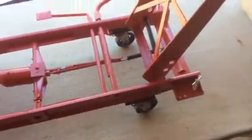I wanted to make it a little bit larger. This bed is 7 feet long and 27 inches wide. I wanted to make it a little bit bigger, so I took a piece of plywood, an 8-foot piece of plywood, and cut it down to 3 foot. Put these little cleats on it that'll rest against the edge here, so that when it's flipped up, give me a second here, I'm going to have to put the camera down. Sorry about that. Now I've got a nice rolling adjustable height workbench that's 3 foot by 8 foot.